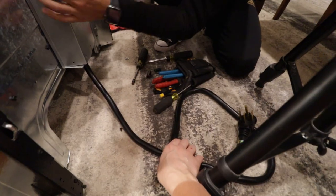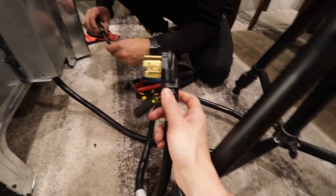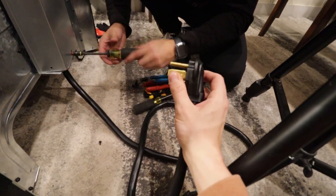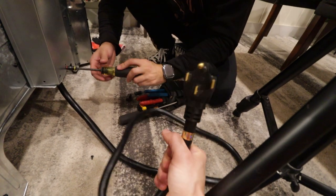This cord doesn't come with the oven — you can buy it separately. We got ours through Best Buy, but they do sell a cord. I prefer to choose my own cords; I think the HDX ones are better quality. Make sure it's a four-wire cord, or three-wire if your house already has a receptacle for it. If you're doing new construction, you do four-wire.